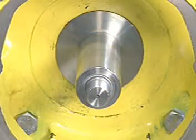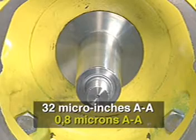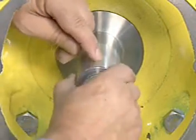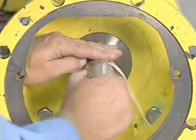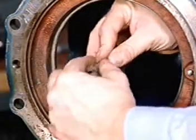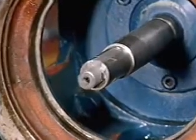The shaft finish should be no rougher than 32 micro inches AA. The shaft surface should feel smooth if you run your fingernail along it in the axial direction. If the surface is not in acceptable condition, polishing will be necessary. Remove all burrs and sharp corners, especially in areas where the O-ring seal has to slide. If necessary, cover threads and keyway slots with thin tape to prevent cutting the shaft O-ring.